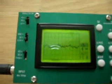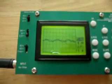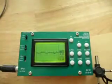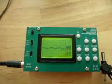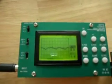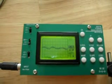I'm going to change down to the lower scale — we're now on 0.1 volts per division — and we can see that there's just general noise going through the system to my body, and that's the way it should be. The whole house electrical system is switched off right now; we're running on a car battery, and there is no AC voltage present — we're just connecting into the ground system.